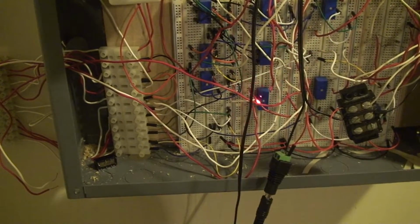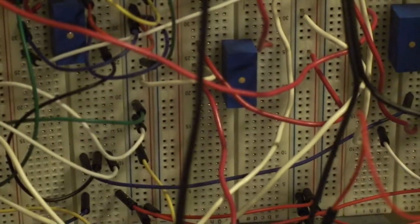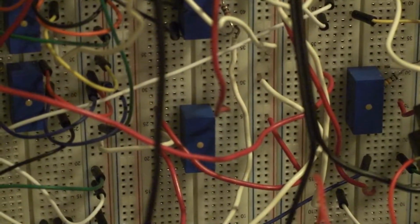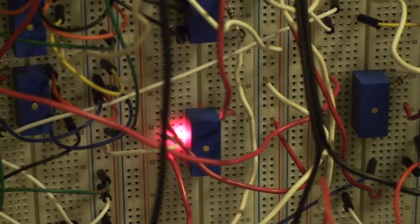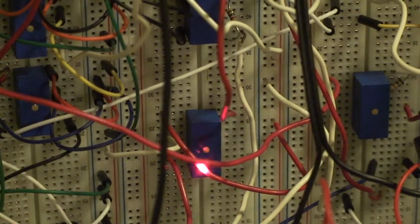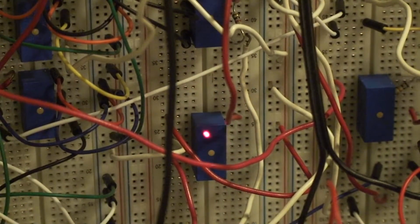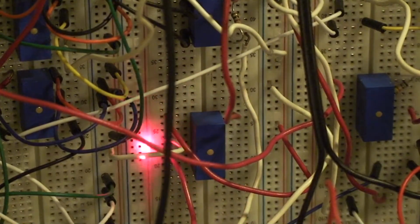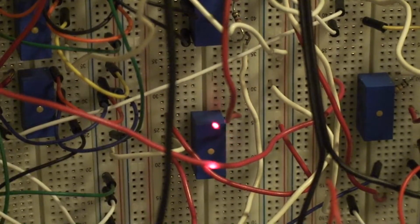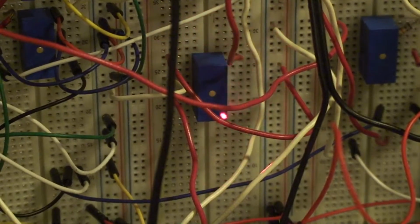That's the newest one. That controls the power going to the smoke detectors, or smoke detector, because there's only one of them. No, that wasn't me hinting at a surprise. There's only one. So that goes to the smoke detector. That controls the power going to the smoke detectors, so that when you press the reset button, this relay will turn on, cutting the power to the smoke detectors, and then it'll turn the smoke detector off, and then it won't have power anymore.